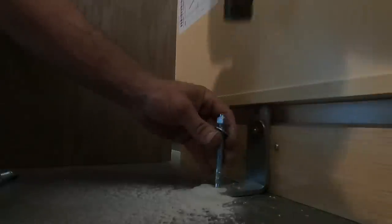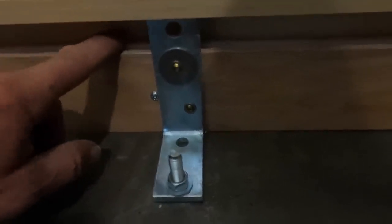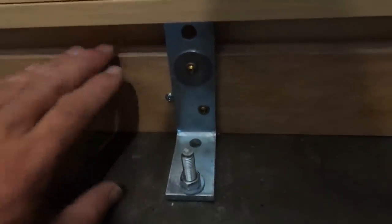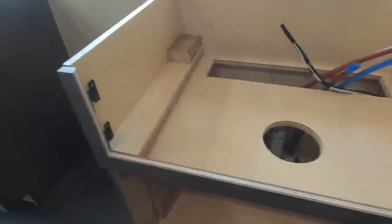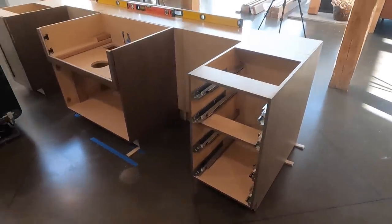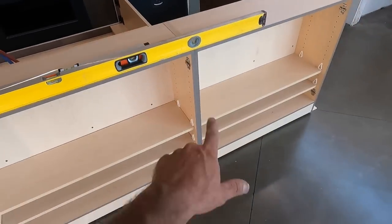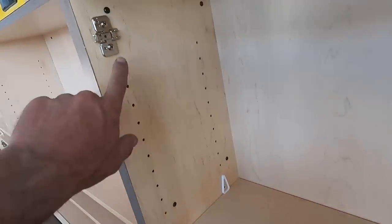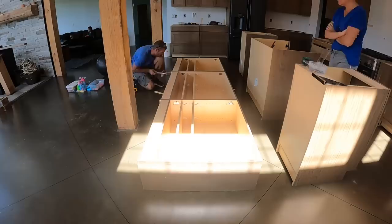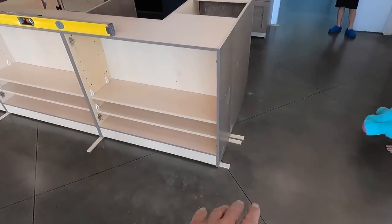To keep this whole thing rock solid, I took some angle iron, put a three-eighths bolt into the concrete, then two screws through three-quarter-inch hardwood and into the three-quarter-inch plywood of the cabinet. I've got one anchor on each end — this thing doesn't move at all. What I did was lay all three cabinets on their back on the floor and screwed them together through the sides so it was basically one big cabinet, then Emily and I stood it up. It was really easy to level because it was all locked together — we just shimmed it, and it was level.